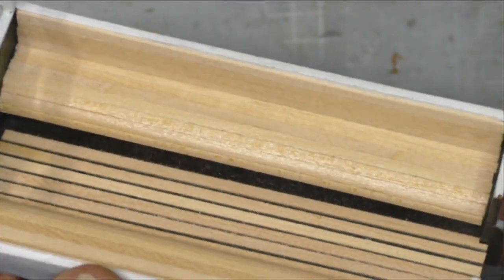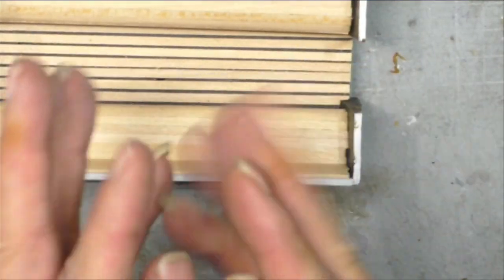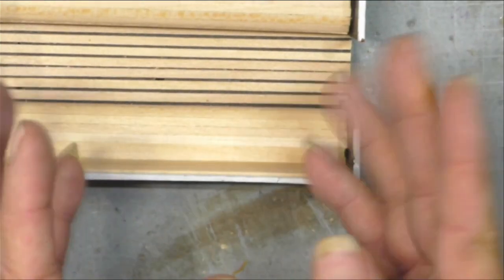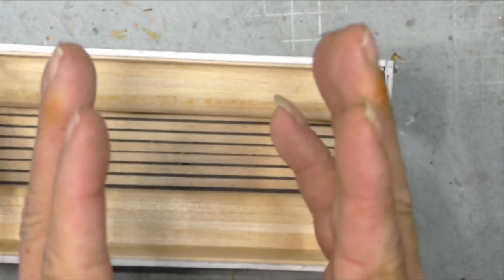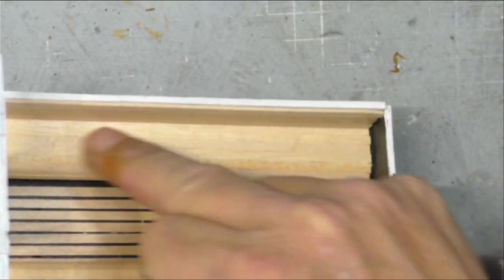It's all fairly even. Now that I've actually done it, I can feel a very slight roughness. I don't know if the varnish has brought it, because my theory is when you sand wood down, if you look at it at microscopic level, you get all these little pokey out bits, which makes it really rough at microscopic level. Now as you sand, you're knocking them down, and then once you get it damp, which you would have done with the paint, it would have enabled them to come up. And this is why in woodwork you do knock it down. You varnish, you knock it down.